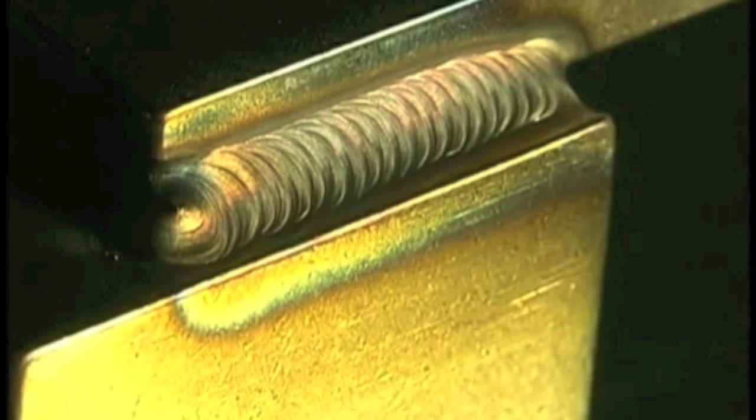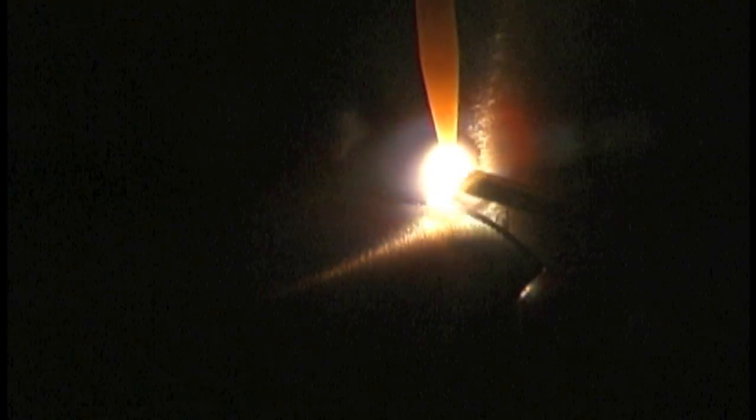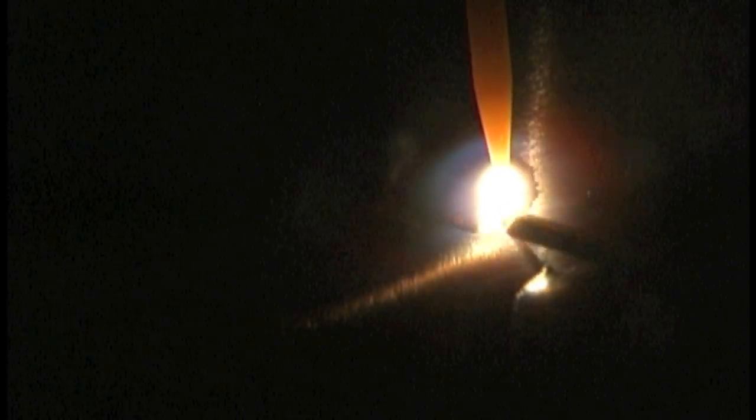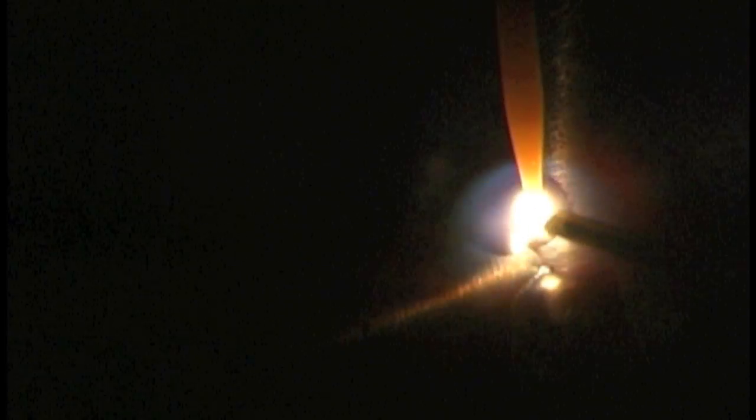What I'm showing here is some pretty thick stainless steel where I'm using about 70 to 80 pulses a second. What it does is really direct and focus the arc, keeping the bead from getting too big and keeping the edge of that bead from wicking and wandering over to the edge and melting a corner off. There are lots of uses for pulse welding at both high and low speed. I'd say I either want to pulse at about 1 pulse a second or over 30 — pretty much nothing in between, because it's annoying when it's flickering and hard to focus on.